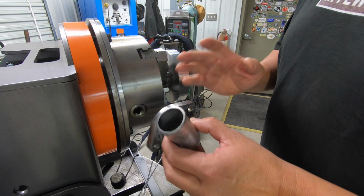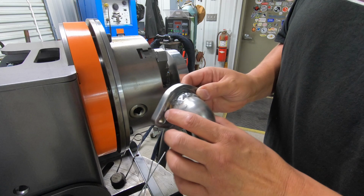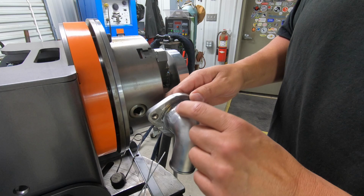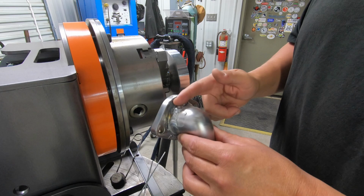And what Joe recommended you do is weld it low amperage. Try to weld it not cold, but just try to weld it as low as you can, small beads around it, and keep the heat down. He says weld some and then let it cool down. Then run another bead over there, and that usually will help clear that up, instead of continuing to pull the impurities away from the other material up into your weld there. So that's what we're going to do. It may take several passes around this to get this thing welded up.